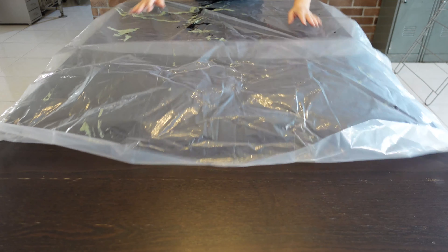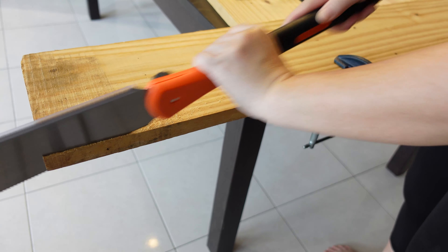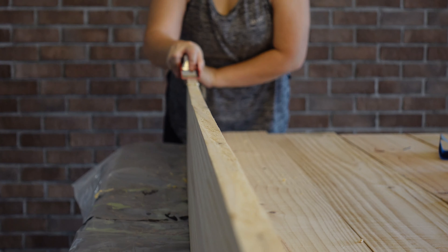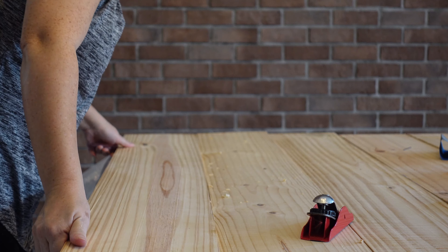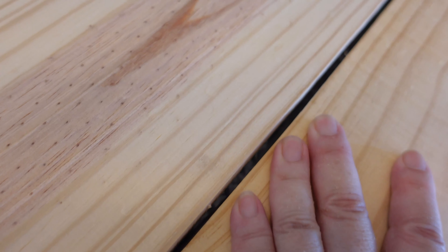After lugging the five pieces of eight-inch white pine plank back, I set them on the table to get the best combination. Because the planks are reconditioned, they don't really have very straight edges and they don't align properly against each other, so I had to saw and plane the planks to hopefully straighten them out. After planing, there are still some gaps — especially here and there — but it's much better. The gaps are much closer together; before planing it was really far apart. As you can see, there's still a bow here.